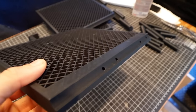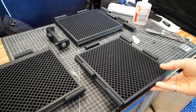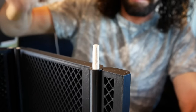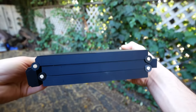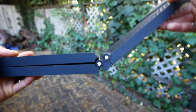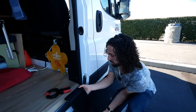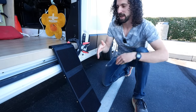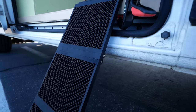I completely redesigned the hinges. Instead of having them clip on, I did full barrel hinges — 3D printing the barrels in a different orientation so that they were as strong as possible. And for the pin, I just used a dowel. It should be nice and strong. And to make this thing as rigid as possible, I also increased the thickness — the link design was about 0.4 inches and this one is 0.7 inches. I'm not going to apologize for using inches with 3D printing. The trickiest part was figuring out how to actually make it fold up, since all of the hinges have to go in the same direction to get a nice rigid ramp. We have these multiple folding sections, and this link on the end doesn't lock into place — it's so I can put it on the edge of the van, and then I've got this clamp here. So I went with more of a ladder design. After seeing Penny try to get into the van, I think all she really needs is somewhere to get her back claws on, and if she can grab onto here, as long as this is strong enough, she should be able to get up.